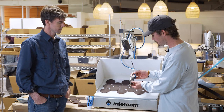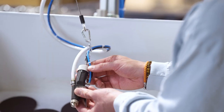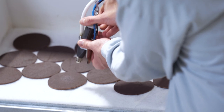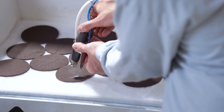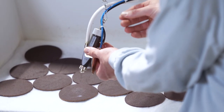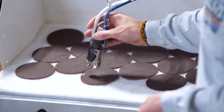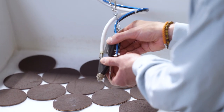To narrow the spray diameter, tighten the screw clockwise all the way to zero, then gradually back it off while spraying until you start to get a small amount of glue and reach the exact diameter you want. Another key variable is how far the gun is from the surface: the closer it is, the smaller the diameter; the farther away, the larger the diameter. So you have two variables — the screw adjustment and the distance from the material.